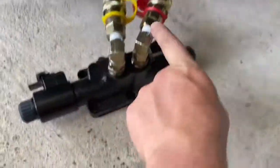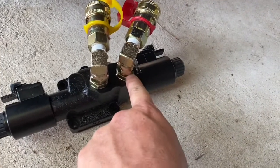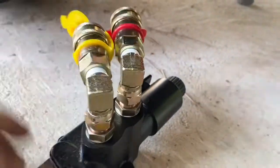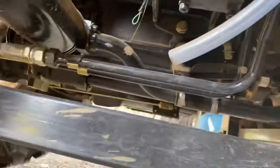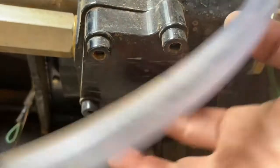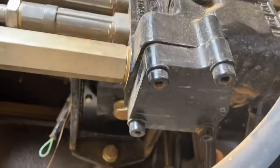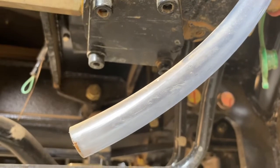Done — install these. I've got it tight here and I went in and Teflon'd that. Got the crush washer under there and I Teflon'd it, but I don't have this tight yet so I can still pivot these if need be. I'll tighten that up once everything's plumbed. Now you put this up right under there — four bolts come off and that goes up there in its place. I don't really know how much hydraulic fluid I'm fixing to have to deal with, so I got a bucket there and I'm probably going to break three of them out.